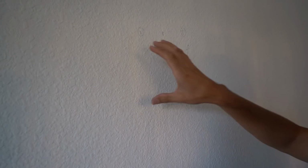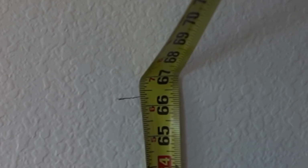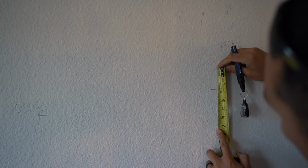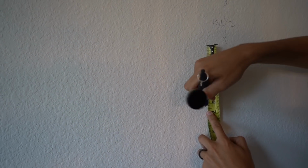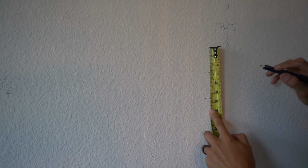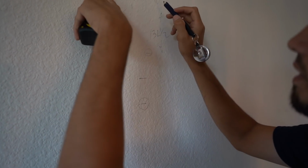And we're also gonna put a rail going through this style midway. So that would be 66¼. And then if we check it from the floor, we should be right at 66¼. So we're perfect there. And we're also gonna split a 1x6 on that. So I'll hold my tape at 2¾, mark here, and then mark 5½. So we'll snap that horizontal line, and these two.